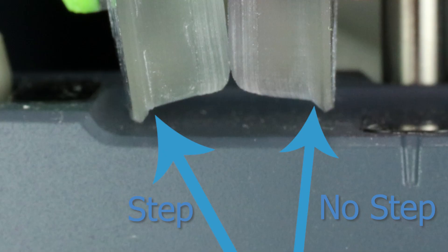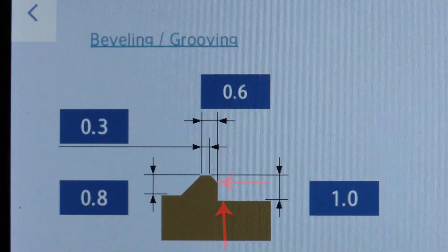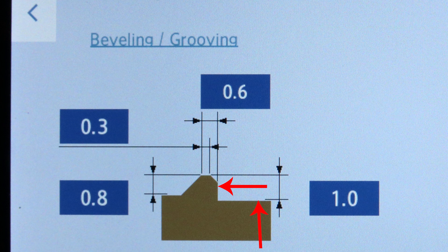The lens on the left has the step bevel, the lens on the right does not. A much better way to see it is from the edger confirmation display — this is the bevel profile in the default or no step bevel setting, and this is with a step bevel. If you caught the opening, I said we were going to do the high curve two-step — and there it is: a 0.3 clip off that corner and then the full step or ledge that allows the frame to clear.